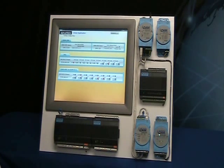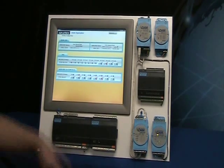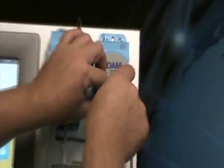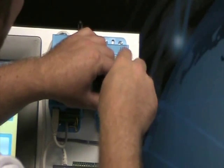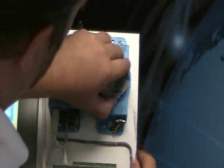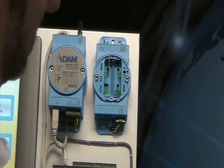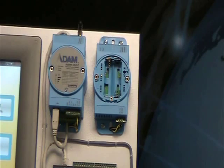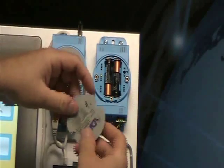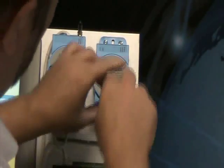For the ADAM 2000 — remember this is battery powered. If you look here, the battery level says there's nothing, no green. So the first thing you need to do when you get the demo set up is to come over here and remove the small screw on the ADAM 2031Z. You'll need a small Phillips and a small regular screwdriver. Pop this off, and by default these demos will come without the batteries installed, so just install the two AA batteries and put the cover back on and reinstall the screw.